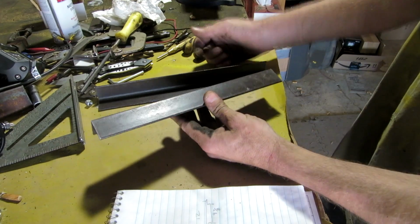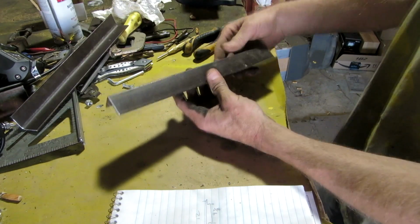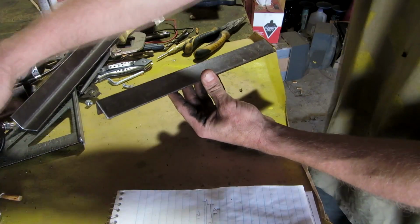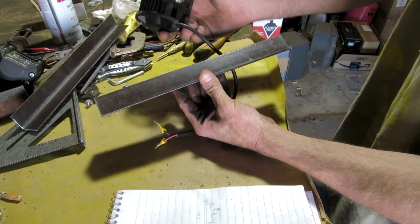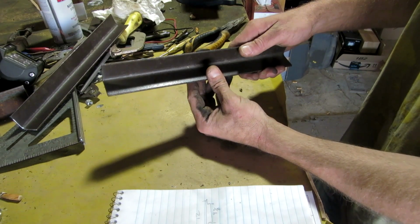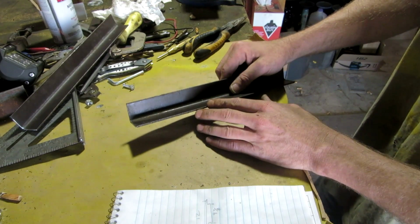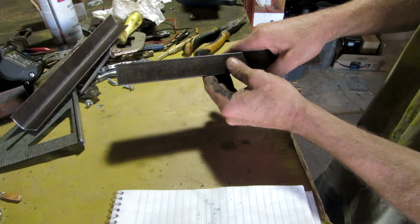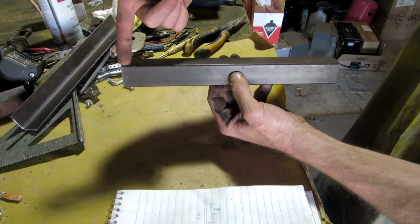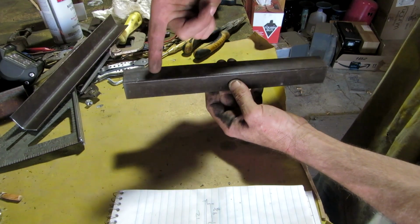Now the 12-inch goes in back. Now I need to find the center of this 11 and a half and drill a hole the size of the mounting bolt. Then, because this is going to seat in between the two bars, I'm going to need to notch out a 1-inch section of the angle iron.